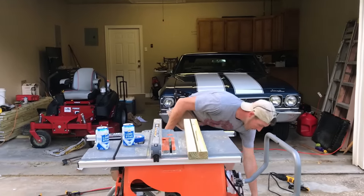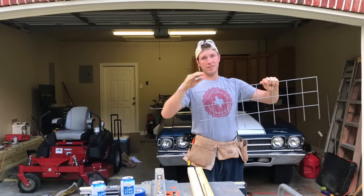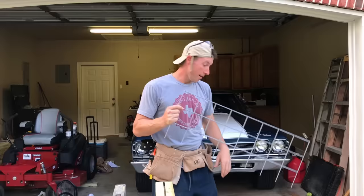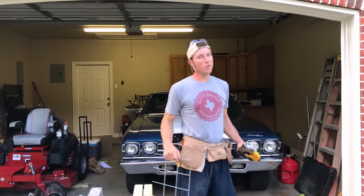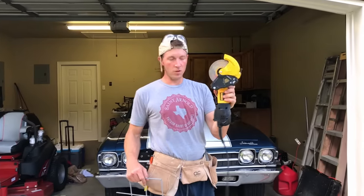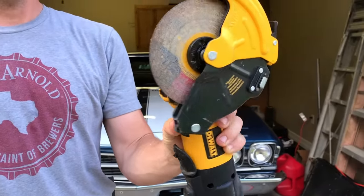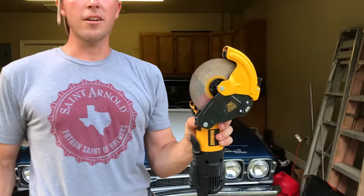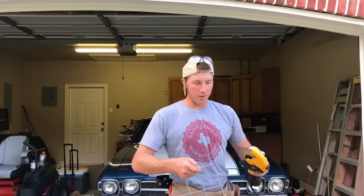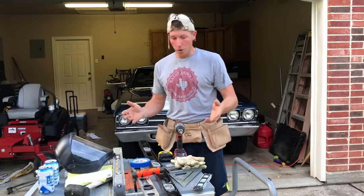This fencing right here is 4x4 squares. It comes in a 50 inch height, 16 feet long. So I had to trim them out. Trimming them out, you can use cutters, or you can use this little miter saw or cutting wheel set up like that. It takes about 2 seconds to do it instead of having to use a bunch of leverage.